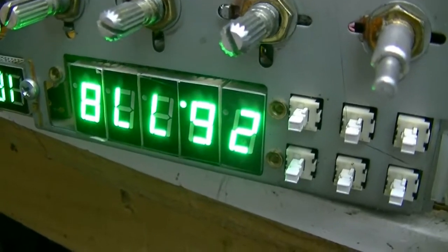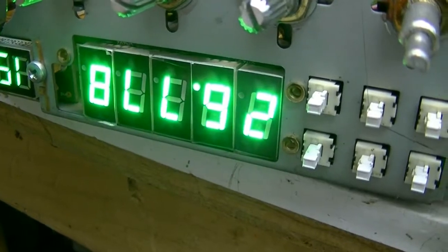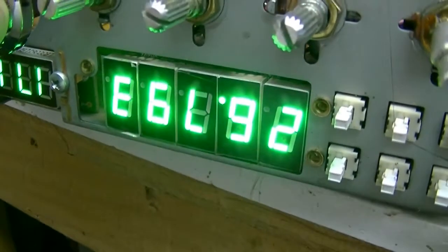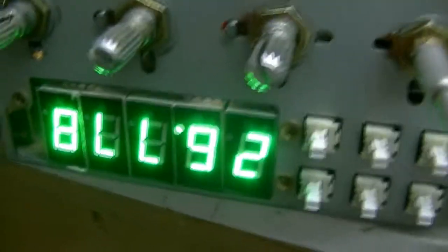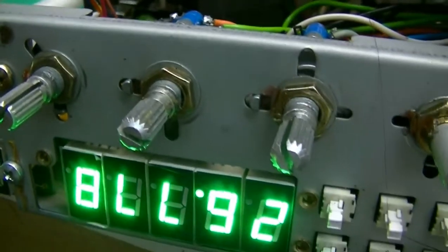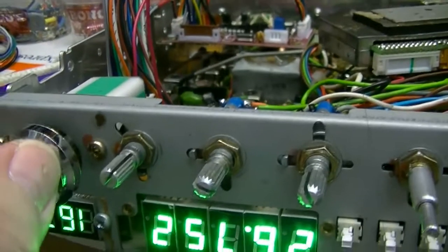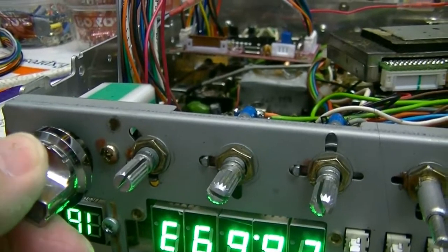Until the clarifier unlocks. Go back up here — 26879.78. Right there the clarifier starts to unlock. Now if I keep tweaking the VCO, I can get it to go on down. See, it continues to go right on down.